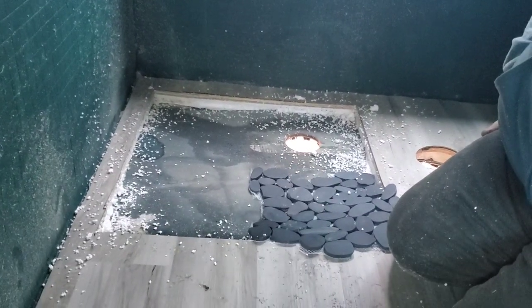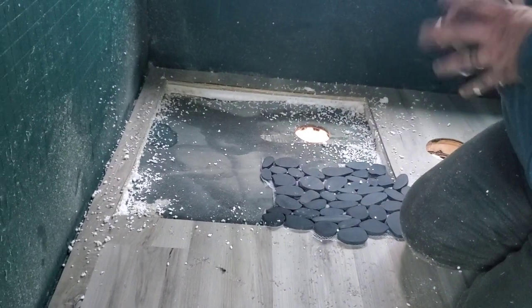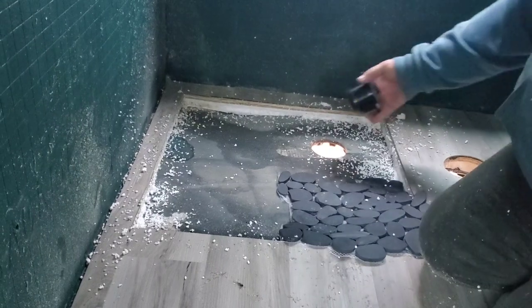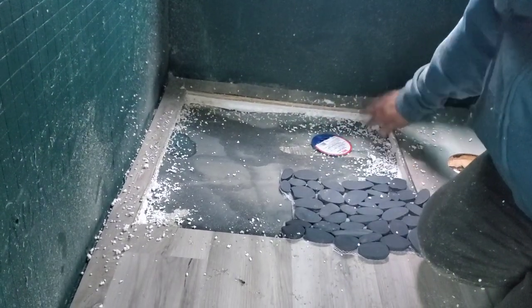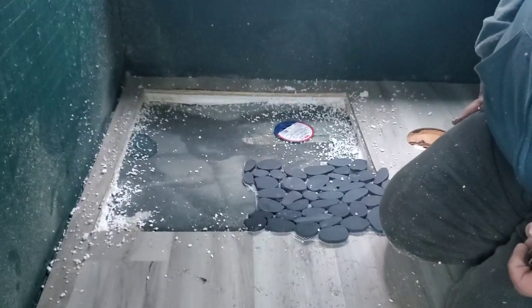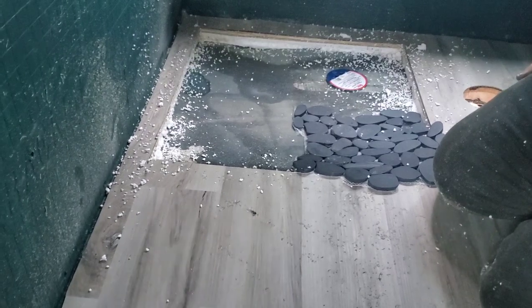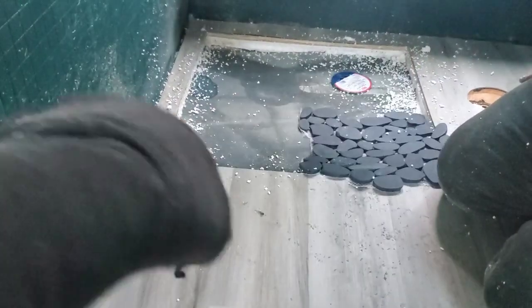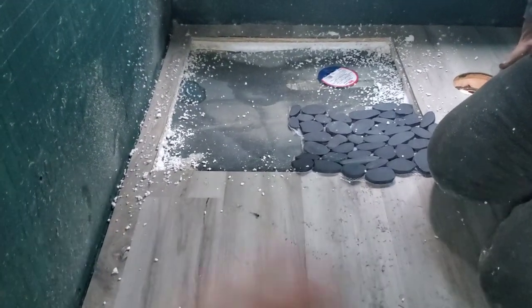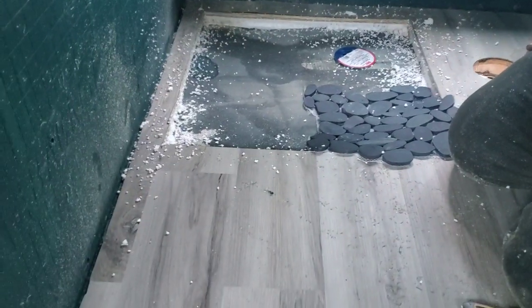It's pitched towards that hole right there - Dad, you want to grab that and put in the shower drain? So my entire floor is still waterproof, but I will have a stone pitched center there where I'm gonna stand and take my shower. If water gets on the rest of this floor, no problem. Just take my squeegee after the shower and squeegee it towards the trough area - it'll all drain down the shower drain. That way I don't have the majority of the water getting everywhere else, but if it does, this is all a sealed waterproof floor.